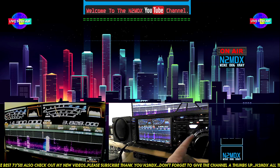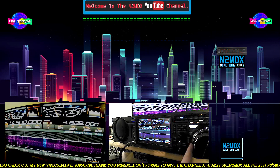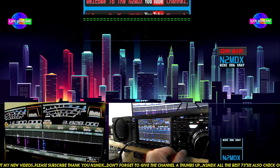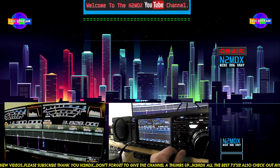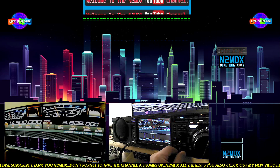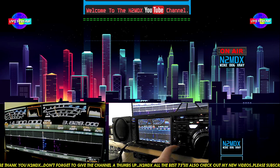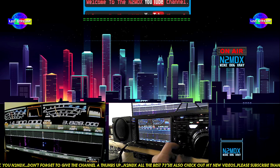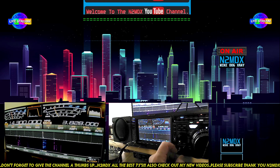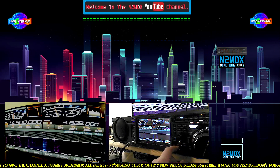Back the other way with the VC Tune — you can see it on the waterfall as it affects the receive. So there you go: AMP2 on with DNR and VC Tune, shifted a little bit to the left. Including the Caribbean Sea and Gulf of Mexico. Now if you want to get really quiet, let's cut back the RF gain. Now come back a little bit with the VC Tune, put RF gain in the middle.